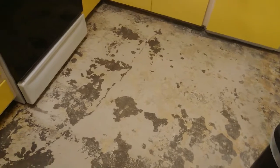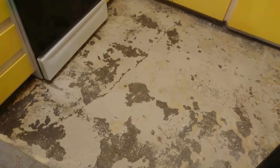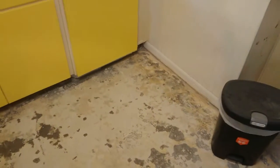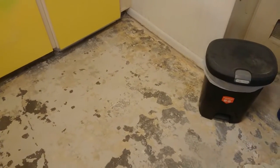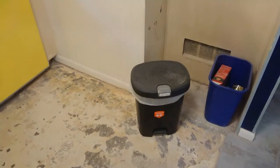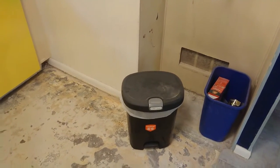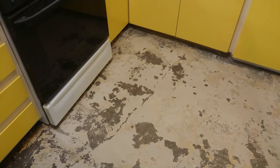All these cabinets are going to come out and this is going to be one open area. I'm hoping to get all the tile removed and then get to a point where we have the bare walls. This beadboard wall is all going to come off. We're going to be moving around some of the plumbing and electrical, because this whole cabinet orientation is going to be flipped around into this corner. This whole wall indentation is going to be re-leveled and made smooth. We're starting with the floor here and I'll see you in the next video.